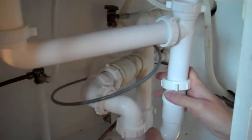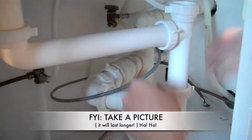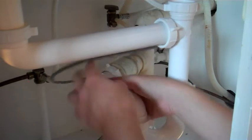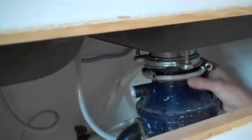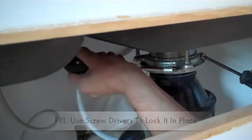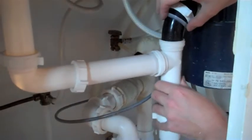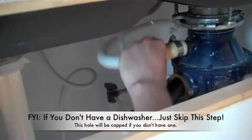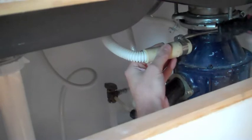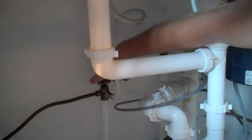Now it's time to put together all the rest of the plumbing. Here's a tip: if you're not good with pipes and plumbing, take a picture of the pipes before you disconnect them — that will give you a guide when you put them back together, because your pipes under your sink may not look exactly like mine. Then, on the other side of the sink, it's time to put in the garbage disposal. Connect the disposer to the pipes, making sure it's really good and tight, and then connect the hose from the dishwasher. Once you have all of the pipes in place and really secure, it's time to turn on the water.